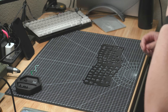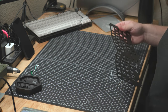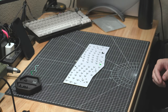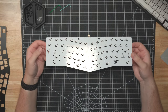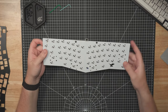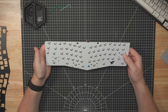It'll be an interesting contrast to the AV3, because the AV3 is just a heavy beast of a keyboard. And has arrow keys, where this does not. So let us prep our PCB. Again, I have already tested this. Always, always, always before you build a keyboard, plug your PCB in, test each location with a pair of tweezers, make sure it actually responds. But you'll be really mad if you find that out after you assemble it. I don't imagine that is the order you want to do those things in.